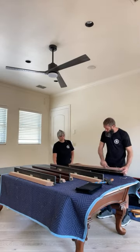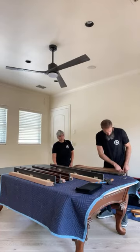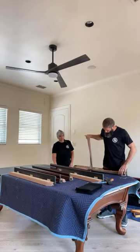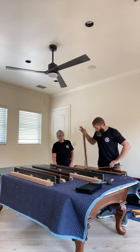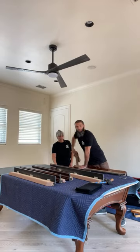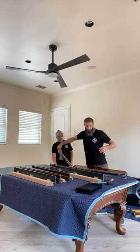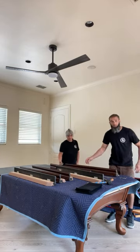You're going to have a feather strip down in here. And when you pull this feather strip out, you got to be careful because sometimes it'll break. So pull it up, and look, that one comes out easy because it's real thin material. But you can also lift this a little bit to assist it to come out. Or some people put it down right here and pull it out so it doesn't pull the feather strip up and explode it into 5 million pieces. Okay? She's going to start removing staples.